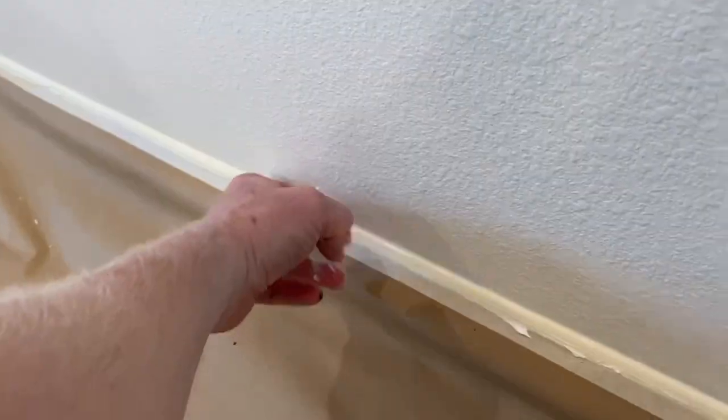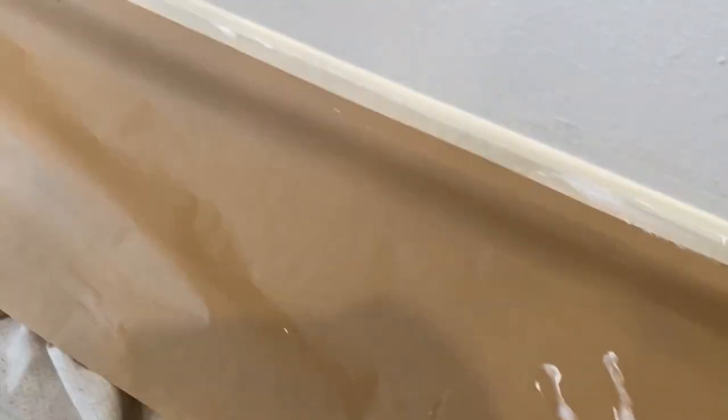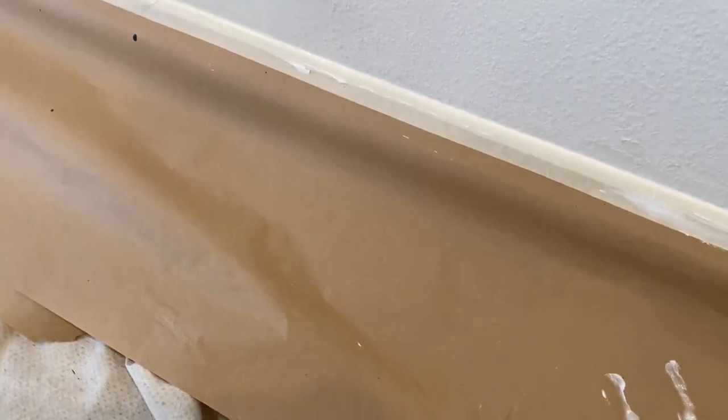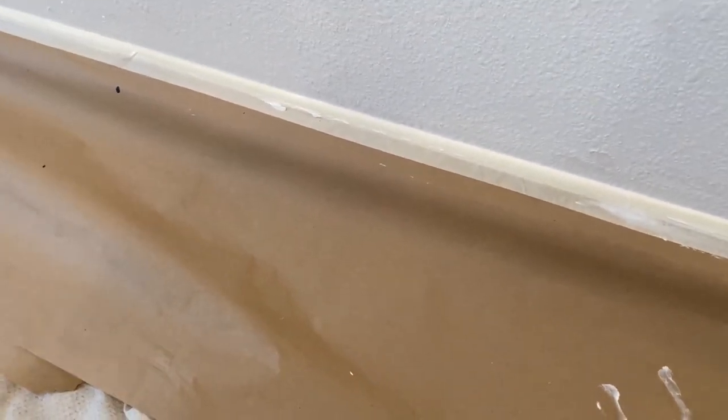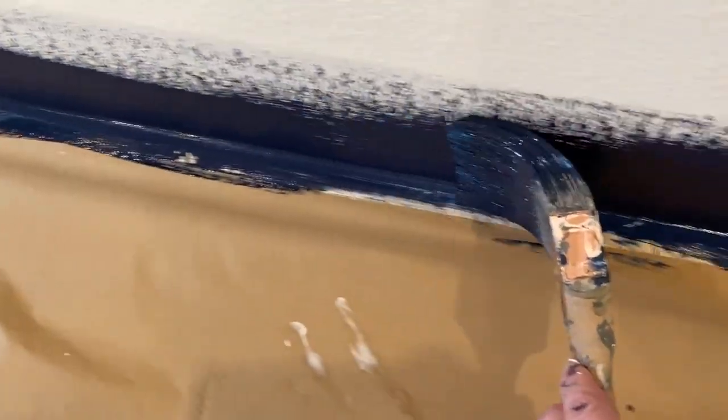Remember, the caulking is a substance that's thick, so you don't want to be going up and down. You'll aggravate the viscosity of it, and it'll ooze out. So just one direction, pull it nice, put a lot of paint in there, and let it dry. Remember the bathroom sink earlier in the video? We don't do that. We press the caulking in, preferably with a wet finger, and then make sure that you knock down the ridges that you may make by rolling your finger against it. That's all.